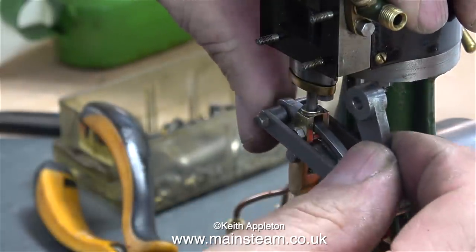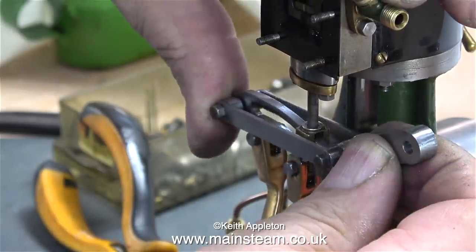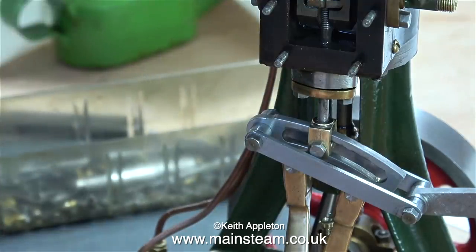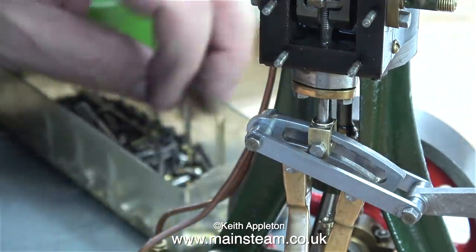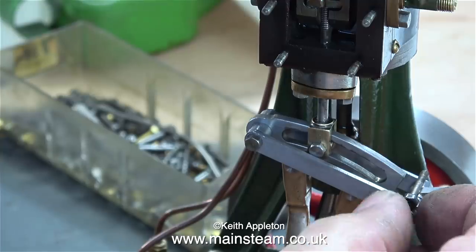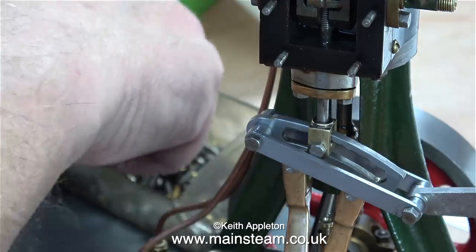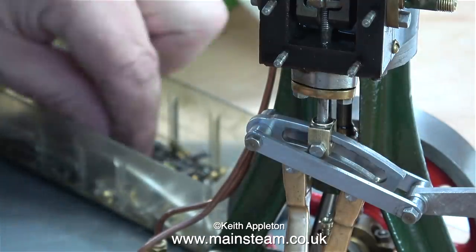Until all of these parts are held together in the bracket and fitted with the reversing arm, it's quite difficult to move the expansion link back and forth. But there's nothing wrong with the expansion link and the valve fork — I've already tested that. It's just a bit difficult to keep everything in alignment at this stage with everything being loose. I'm looking in the small drawer where I keep my 7BA bolts to see if I can find any suitable fixings, but no I can't. I'll have a look and see whether a standard Stuart stud for holding a steam chest to a cylinder fits across this part — if it does, that's what I'll use; if it doesn't, I'll have to make my own.